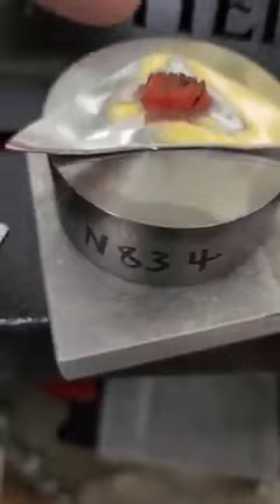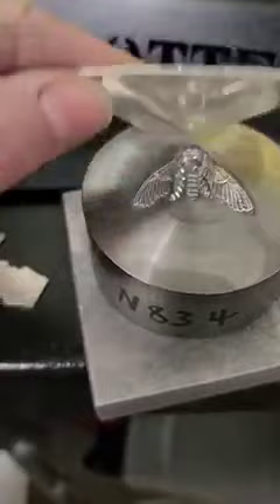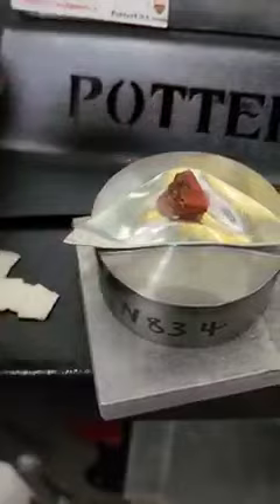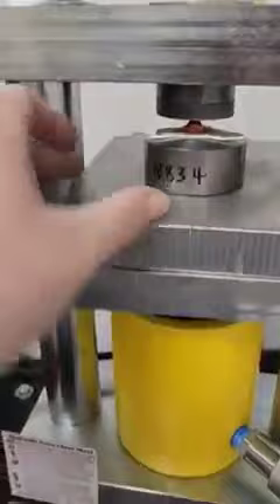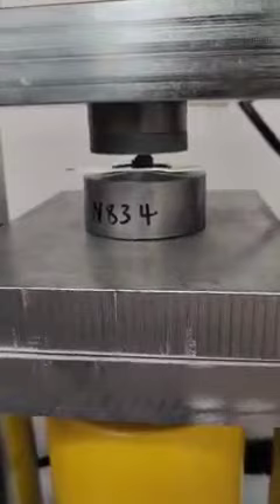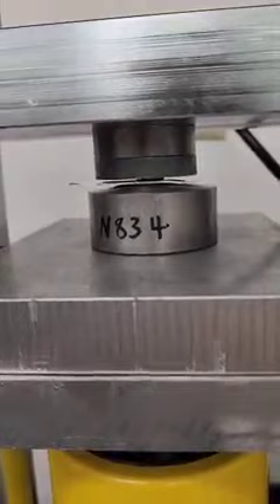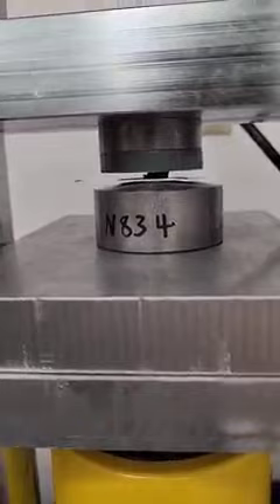I've already done that a little bit here. I used that small piece of urethane and pressed it. I'll show you really quick — I'm not pressing it all the way, not pressing it as hard as I can. I am just barely pressing down on it just so that the metal starts to form down into the die. Not very much at all.